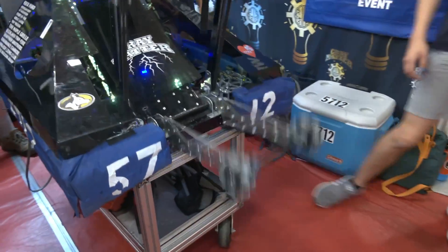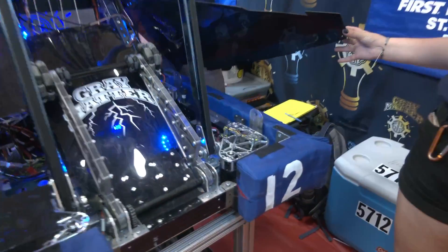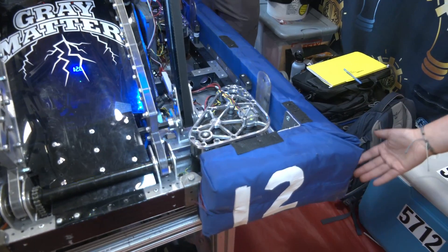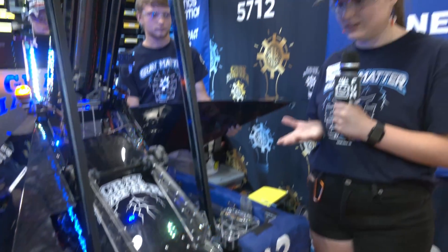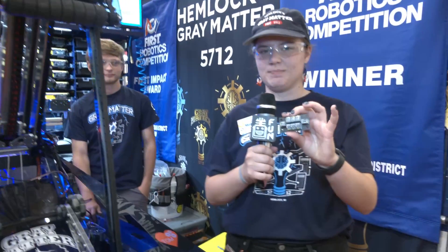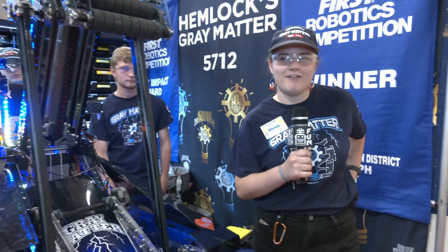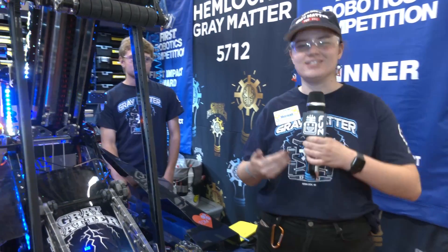Morgan, let's talk about the drivetrain and any modifications you've made from COT, and then the electronics on your robot as well. Pretty common nowadays, but we use swerve — the MK4Is with double Falcons. Not much has been changed, but they work for us. We've got black tread underneath, which we found works better than the blue, just with crumbling and wearing down faster. For electronics, the way we run our CAN system is a custom bus configuration — we have custom CAN buses made. In our opinion, it's easier than daisy chaining, and we don't have to use PWM connectors, which have been unreliable in our experience. This makes it easier and more consistent for our electrical team.